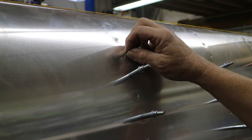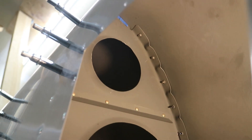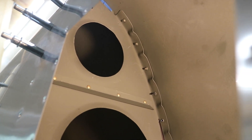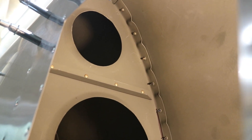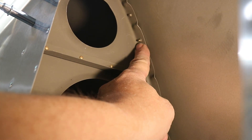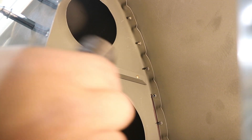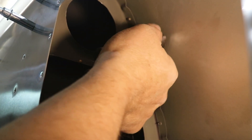So we're going to put this rivet in right here — it's a number three. Here's a look up in the inspection cover for the strut. You can see this little bucking bar fits in here pretty nice and it clears the flute. So as soon as my lovely assistant is ready, we'll buck it.